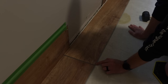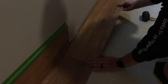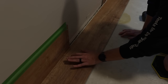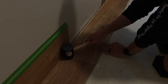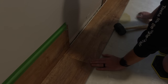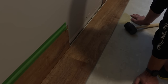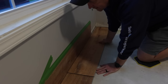I want the dominant protruding edge facing towards me. I get the board nice and straight — you can see it's sitting slightly higher than the first piece — then I take the dead blow mallet and seat it down fully. I run my finger across the seam and it's nice and smooth. The piece is now attached, and that's all you do all the way to the end of the row.